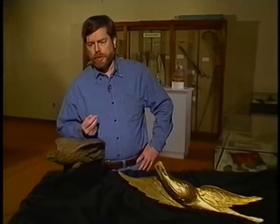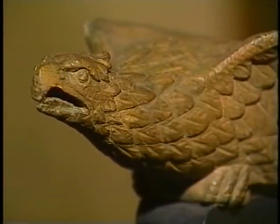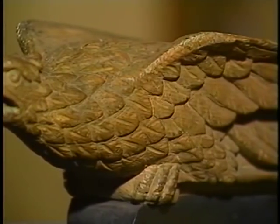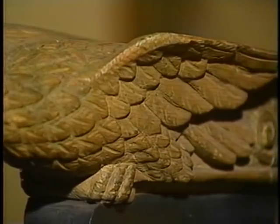This one here is especially interesting. It was a figurehead on a small sailing vessel like a schooner. And what I like about it is how the carver used deep relief carving techniques to create the effect. For example, the beak and the eyes, the details are carved fairly deeply in. And it's done in a sort of realistic style. The feathers along the neck, and as you work farther back, you can tell they've been done with what looks like about an 18 millimeter number 5 gouge, and then the background has been carved away deeply, so they are modeled in a fairly high relief.